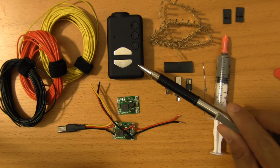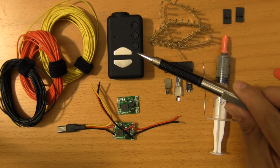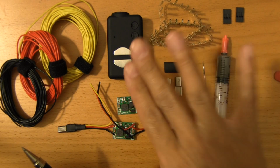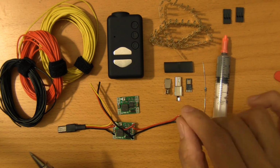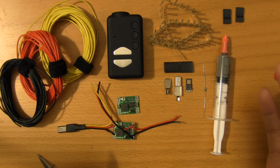one of the things that you can't do is plug this into a receiver port, which is only good to maybe about 125 milliamps. You can't plug this into a flight controller, again, which is only good to maybe about 200 or 250 milliamps. So what you need to do is connect this into a direct power source, which in a lot of cases is going to mean into a 4-cell power rail or a 3-cell power rail.